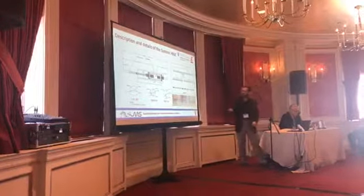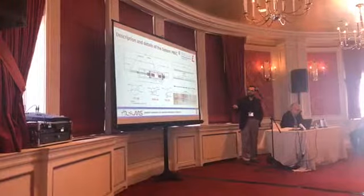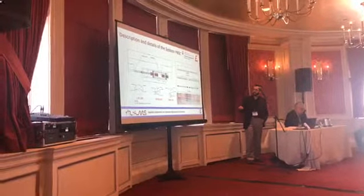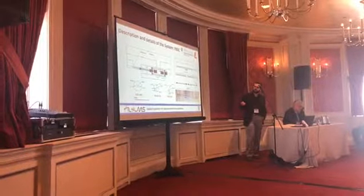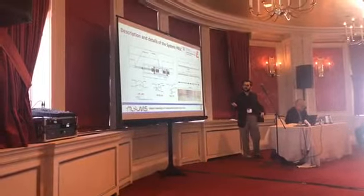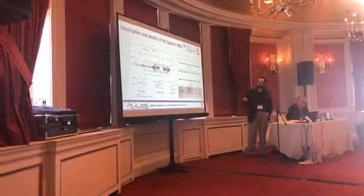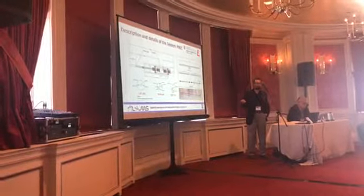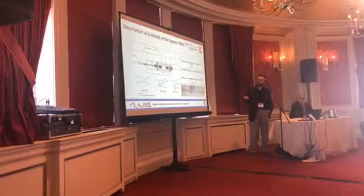So a little bit of details about the system itself. The system employs, as I said, shape memory alloy that was machined, and threads were employed at the ends of each bar. In total, this specific specimen employed 4 SMA bars, and there are 2 fixed plates at the two ends, and in the middle there is a moving plate which is attached to a piston, which actually takes the cyclic load in tension or compression.